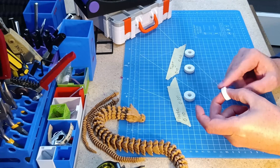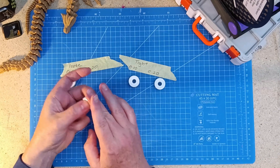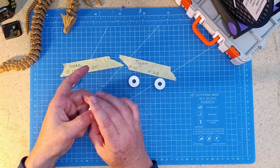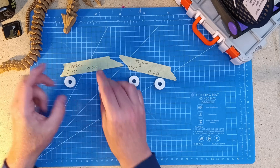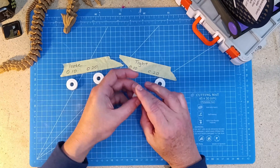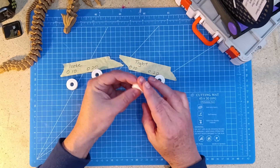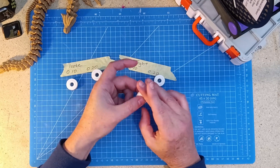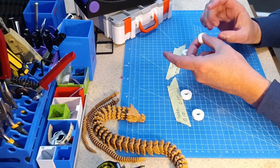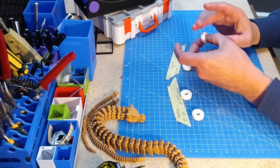Operation is pretty smooth straight off. Comparing the loose ones to the tight ones you can definitely feel a difference. Between the 0.1 and the 0.2 layer height I don't really feel much of a difference, but I think the best ones are the tight 0.1 layer height. So that's the version I printed in ABS to do some more heavy duty tests.